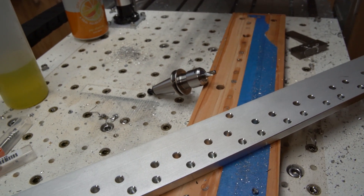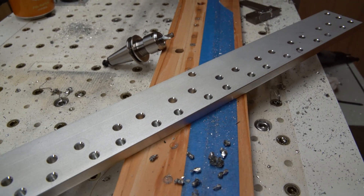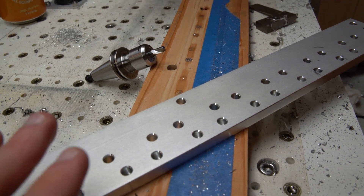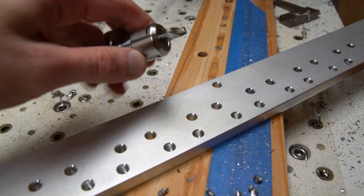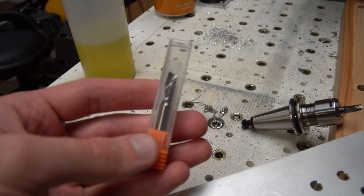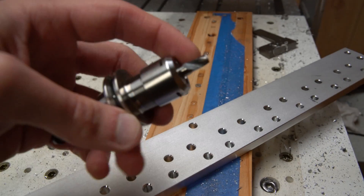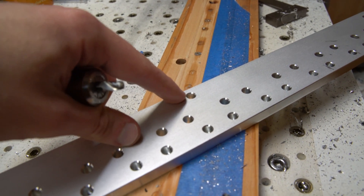You can see machines like Datrons using them all the time, and there's a reason for that — they're ideally suited for high-speed machining. The second thing I want to talk about: if you heard during the clip, the cut was starting to not sound good near the end of the operation. That was because of my poor tool choice — I should have used this one here, which is the same tool but with a 17mm flute length.